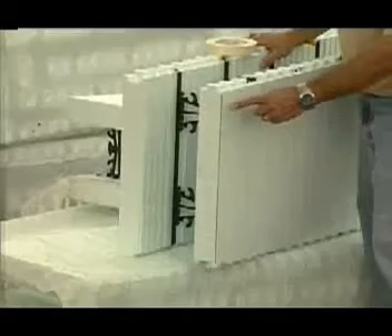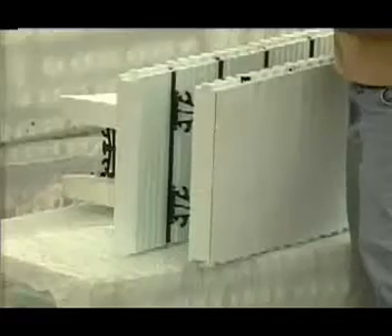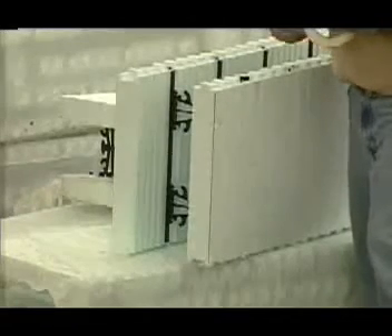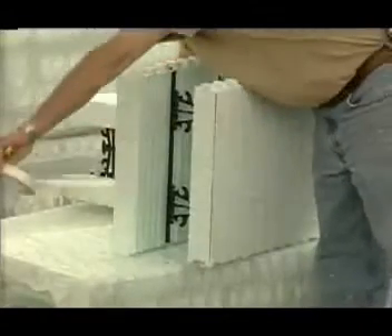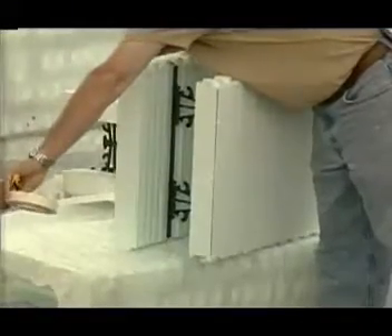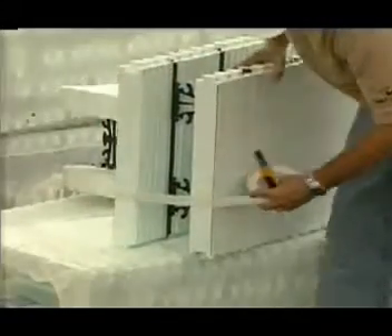If the location of the cut results in more than four inches of unsupported foam, you will have to reinforce the ends to prevent the foam from flaring out during concrete placement. Weather permitting, run two lengths of fiber tape around the cut ends before putting the form in place. Otherwise, reinforce the joint with strapping.